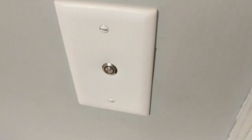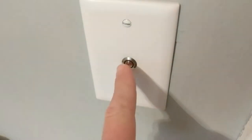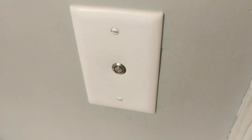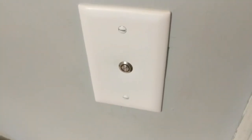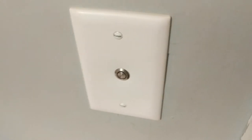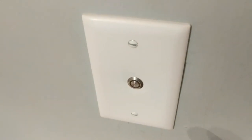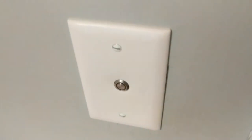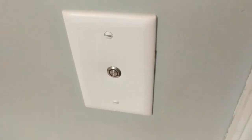If I pull this cover off, it's a lot cleaner inside. There are the two Romex wires going to the actual light from the relay, and then three wires going from the button board to the relay — super simple. The hardest part is running the Cat5 cable down. In this bedroom, when I went into the attic and tried to pull the Romex up, it was nailed down somewhere, so I had to fish down with a couple of clothes hangers, find it in the wall, pull it through, tape my RJ45 cable to it, and pull it up through.